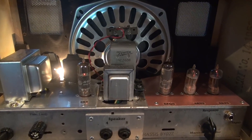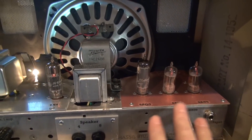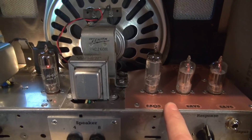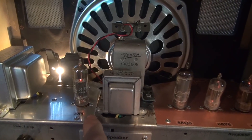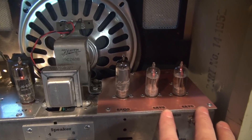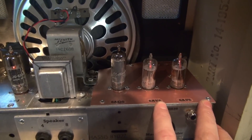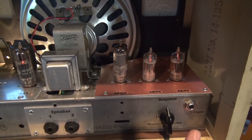The challenge on this amp was to build it using all 7-pin miniature tubes. We have a pair of 6AV6s taking the place of a 12AX7. They go into the 6AQ5 output tube through the transformer to the internal 8-inch speaker. Over here you've got a 6X4 rectifier. If you want to play with some tones, you could get some 6AT6s and put those in to change the gain and character. Also, this amp does not have tone controls — just that single volume control on the front panel.